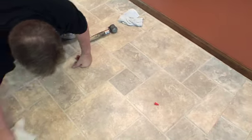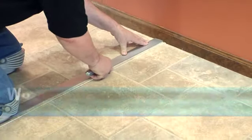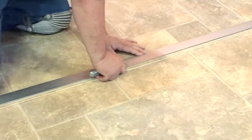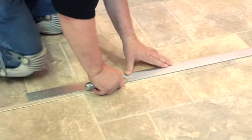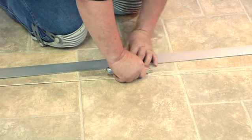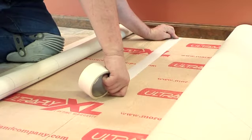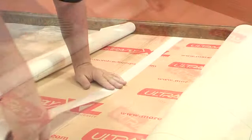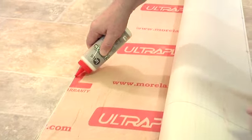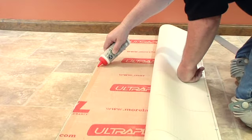Protect the sealed seams on your flooring to ensure proper seam bond. If your seams are disturbed before appropriate dry time, damage may result. For seams in loose lay with tape installation, follow all the same full spread seaming instructions with these exceptions: do not adhere the floor with adhesive. After the seam has been double cut and excess material removed, fold back the seam edge and position double face tape. Fold the material back, align the pattern to complete the seam, and apply seam bond to the edges.